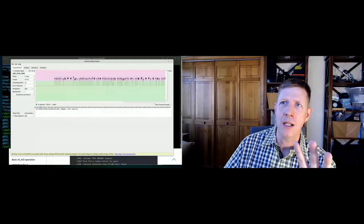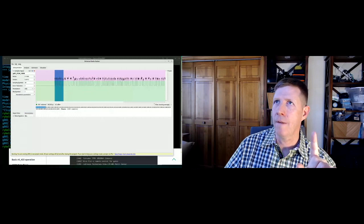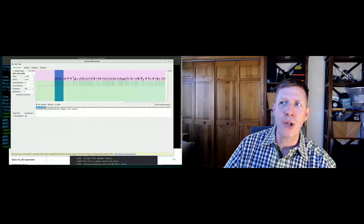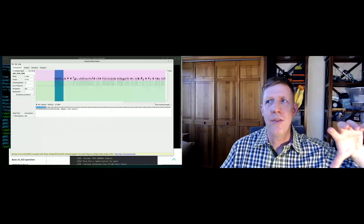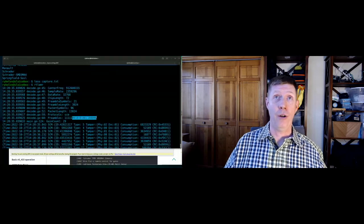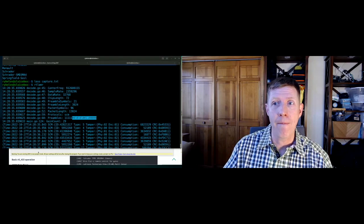I like demodulated. And if you start to see this, like 10101010, that's good. That tells me something. And you remember here in my notes, I want to find 11111001. This is called a preamble. That's basically your clock sync. So I'm going to give you pulse, pulse, pulse, pulse, pulse. Adjust your time as the receiver based on that. And then I'm going to give you this thing. This thing is, oh hey, this is a standard ERT consumption message to follow. Boom. And then it has the data. So if I see that, that's a good thing.